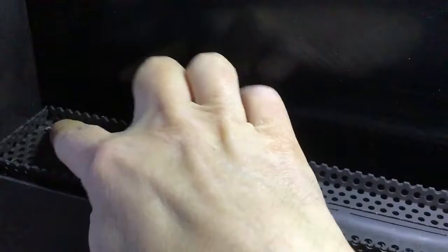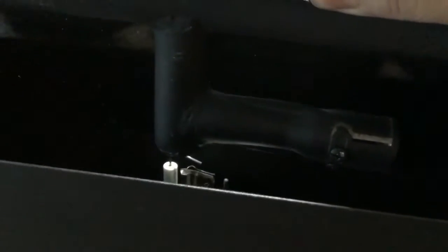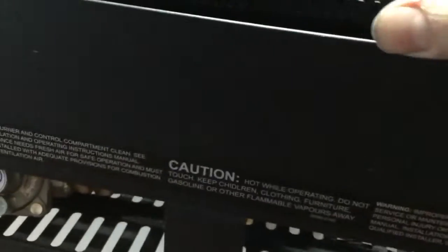I like to use these little magnetic Harbor Freight flashlights to keep things well illuminated while I work inside the fireplace. After you remove the 4 screws in the corners, the diffuser is removed by sliding to the left and then lifting straight out. A can of air is used to blast through the venturi area around the burner hole.